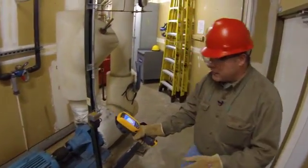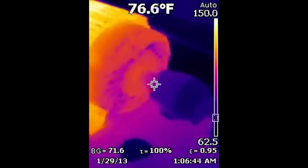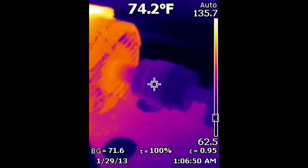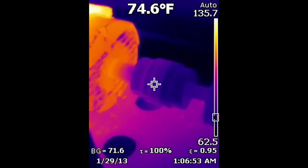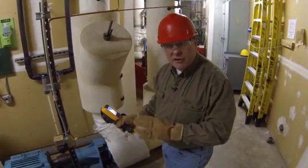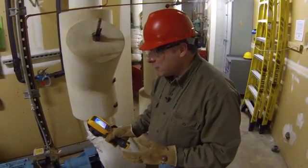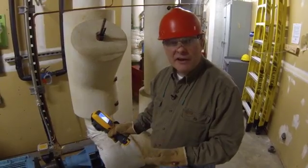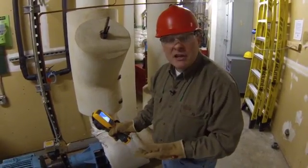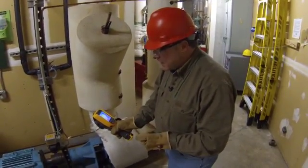We're going to move up here now and take a look at the mechanical portion of the motor — the bearings. We're looking at the shaft end of the motor, and I don't see any issues. If I were to see an issue with this particular bearing, it would be warmer than the rest of the housing. Usually if something is five to ten degrees centigrade above the temperature of the main part of the housing and it's on a bearing area, something's going on. A misalignment, a bearing that's wearing out, over-lubrication, or under-lubrication can all cause the motor-pump assembly to operate inefficiently, draw more power, and not get the work done you want. Everything looks fine — not seeing any issues.